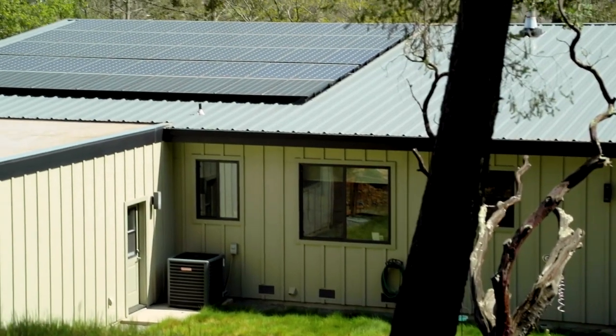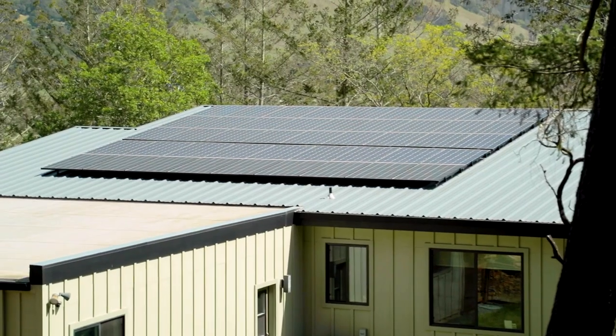For a homeowner considering going solar with IQ8s, it's really about: do you desire off-grid capability now or in the future? If yes, we definitely go with the IQ8s over the 7s because it makes that experience much better. They could start small — just put in the switch with the IQ8s, have some backup capability with sunlight only, do a small backup loads panel, and then add batteries later as their budget allows. We don't have to worry about any sizing issues or ratios, so it gives complete flexibility and future-proofing.